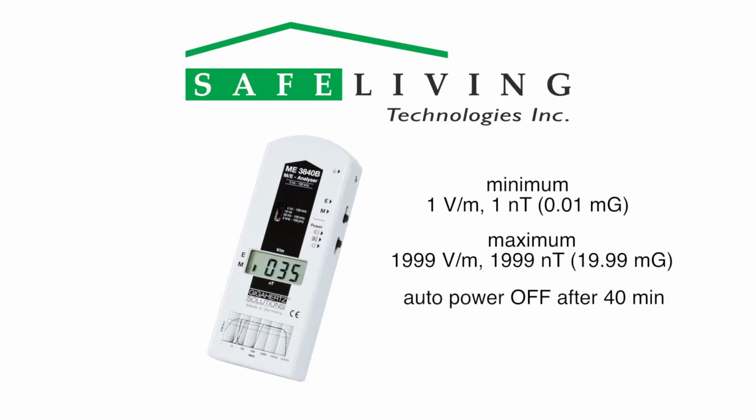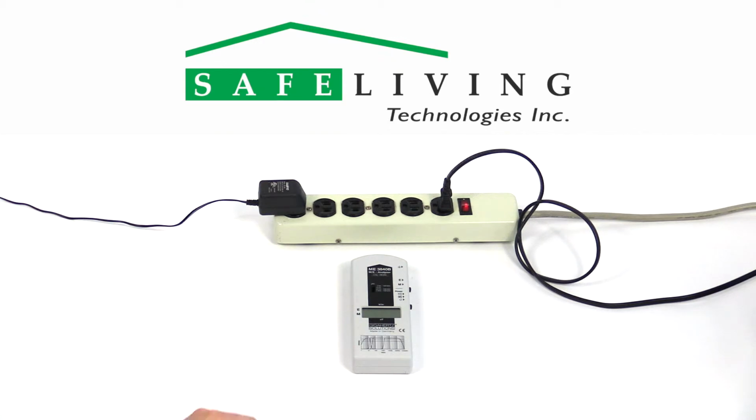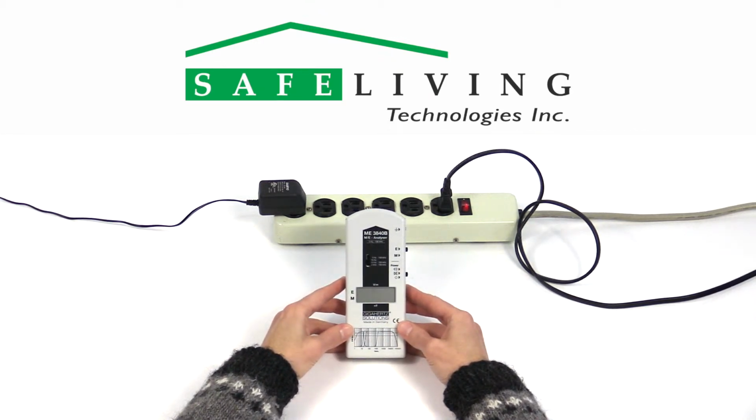The meter includes an auto power-off function after 40 minutes to conserve battery life, and a Geiger counter audible signal that is proportional to the measured field strength to assist with source detection. The ME3840B is a single-axis meter, which is useful for identifying sources of low-frequency EMF.